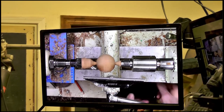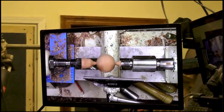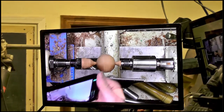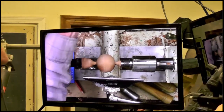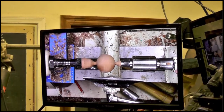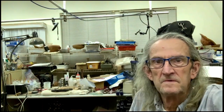I'm going to expand on the question about what are you following — the top edge or the bottom edge. Both sides are going to be the same when you finish, but here's the deal: his camera's right over his head. Suppose you can't put the camera right overhead and you have to have it on a counter behind you or angled — that is when you can't see the tool, but you will see the results. So you look at what I would call the shadow cut — not the actual cut, but the piece flying away from you, the end result.